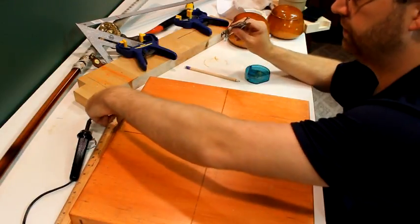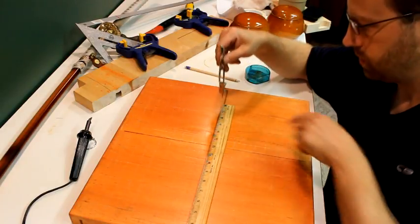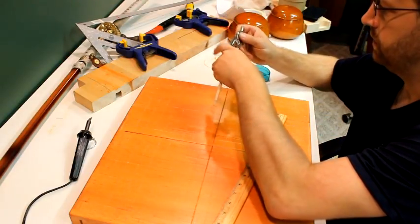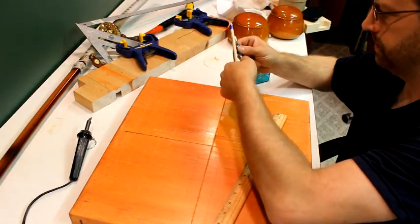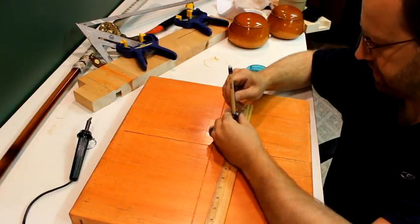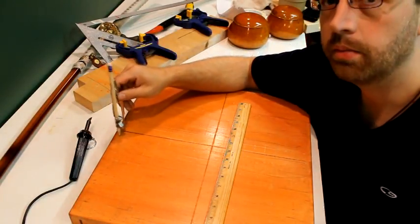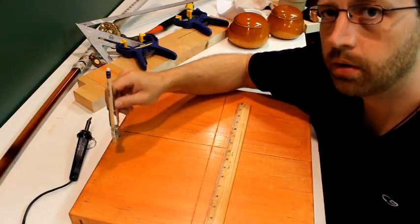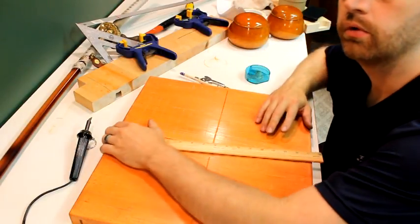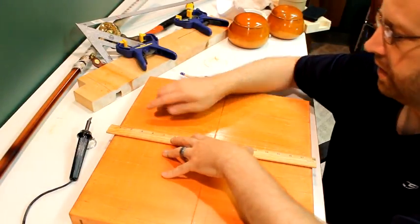And basically how it works is you figure out the distance of the stones that you want, right? And then you put it pencil to pencil, and then you insert your pencil. Say you want, I don't know, 7/8 distance, you measure, and then you go from your line, probably up top, and you put a mark, and then on that line you put a mark, and on that line, and this way you can mark it out with marks. Now you put your ruler from mark to mark, clamp it down if you don't think you can hold it steady, and then draw your lines.